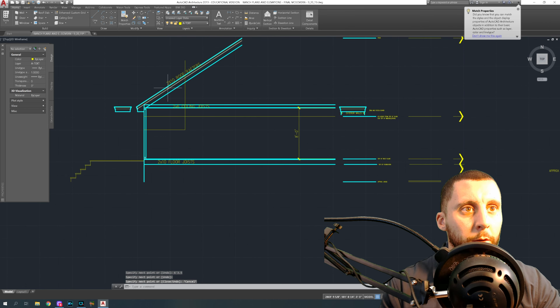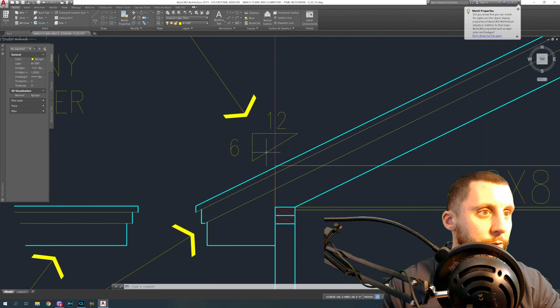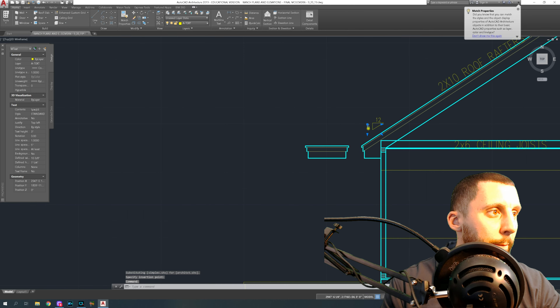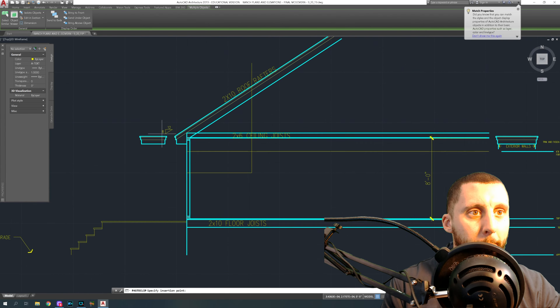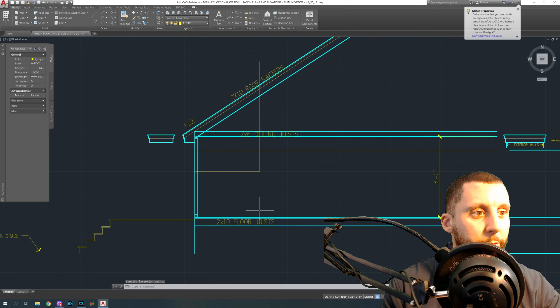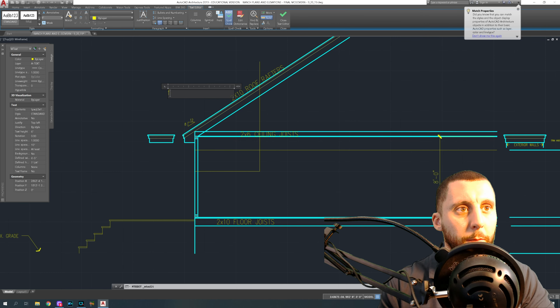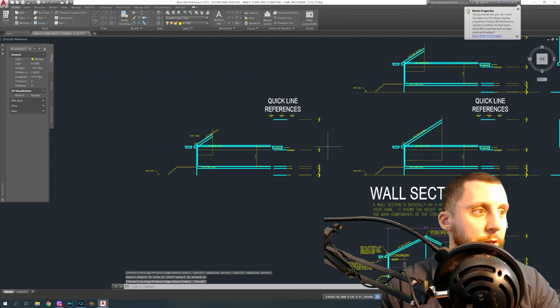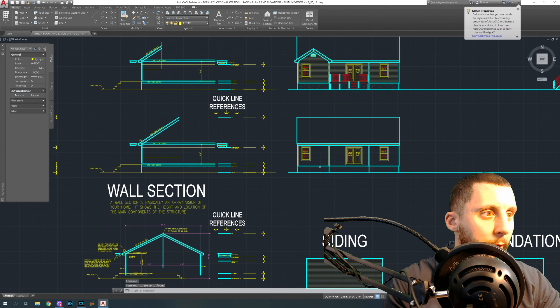The rise and run on this should be labeled — it's an 8/12 pitch. I'll put that on my original one, and that front gable is going to have the same 8/12. I label it 'front gable' over here. That doesn't change any of these lines — it only changes where we trim that off and where it comes back down. The reason for going to the left is that everything is still lined up going through to the front. Let me get rid of my hatch pattern.